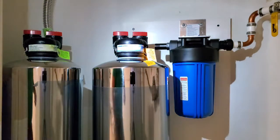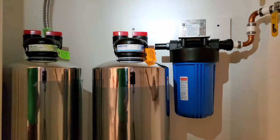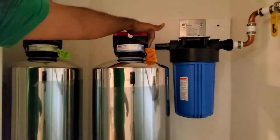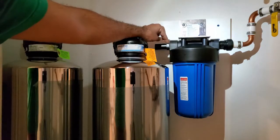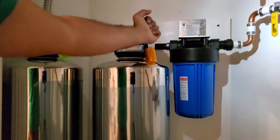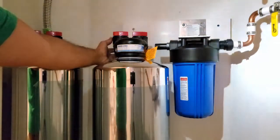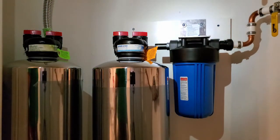As you can see we're in tight quarters here. Because the closet is so small, the pipe that would hook up here is going to cause clearance issues with the tank right next to it. My solution is to remove the straight adapter and put in a male threaded adapter that hooks onto a 90-degree PEX elbow and turns down, then the installation hose connects that way. You won't necessarily need to do this, but it is a solution for a tight fit.